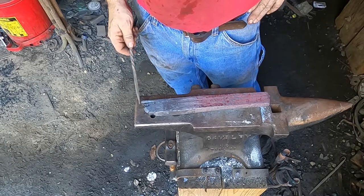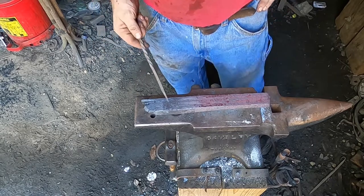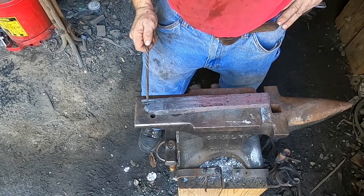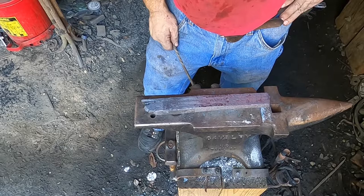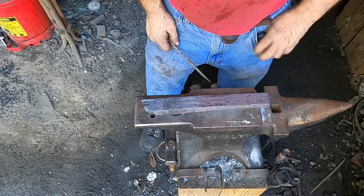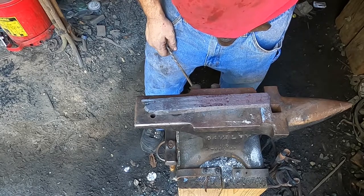And when I welded up the two outer billets of saw steel, I realized that it was better to weld all the way around them and then stick them in the fire and very carefully weld them together. I'm hoping that everything is taken. What I'm going to do now is cut off these nasty ends and hopefully get rid of any imperfections there. And then I'm going to grind the piece clean. And then I'll decide, depending on the time, if I should take lunch, and we'll get back to this. Next step after that will be drawing out and squaring up.